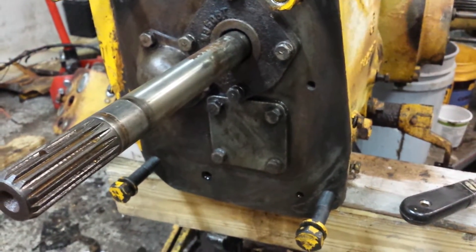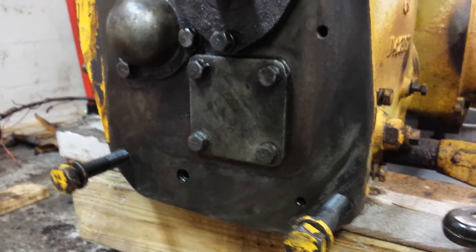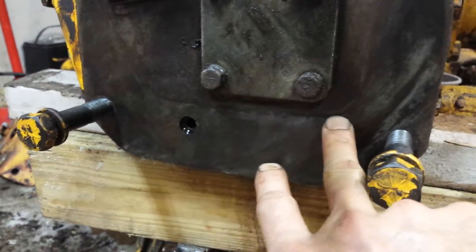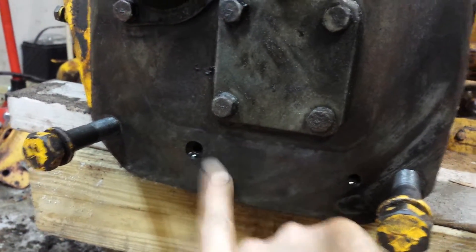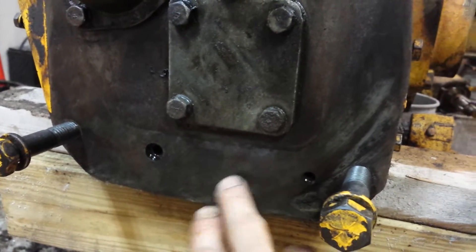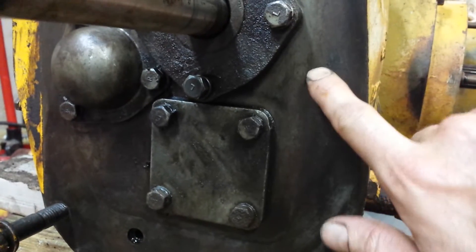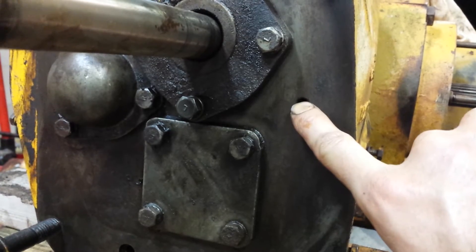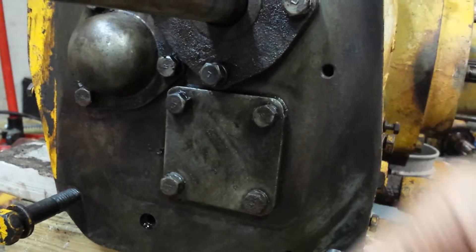This housing does allow oil to come through, but there's no seal, so technically no oil should get through there — those holes don't go through. You can see the plate for the next one sits right here, closing these little holes. You put oil in the housing for the directional reverser, but that oil is technically not shared with the transmission. In my case it was full of water because it had filled up so much that it had come out of one of these bolt holes and seeped over into the housing.